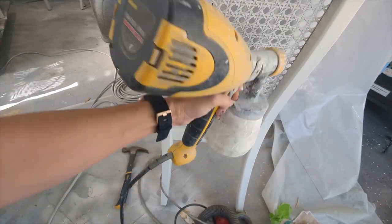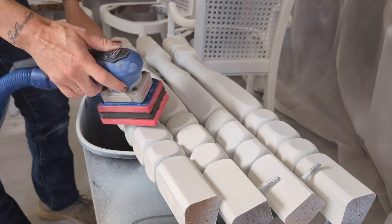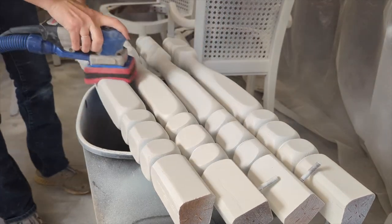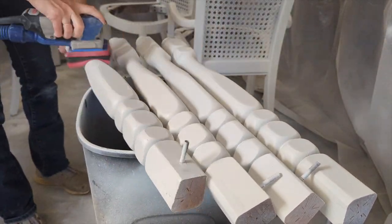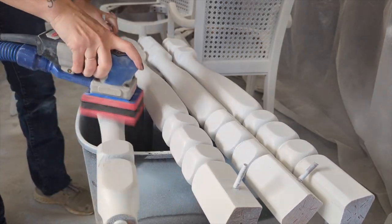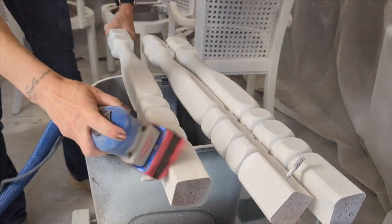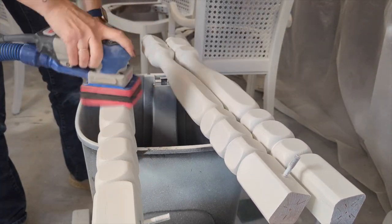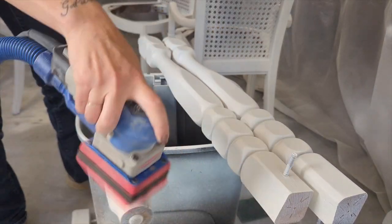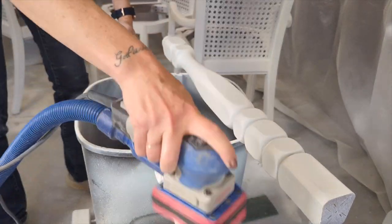I'm going over it with that primer again to make sure that everything is primed and ready to go, and then I can fix any other places that need to be repaired. It's not perfect, but it's a good broken masterpiece. When shellac primer is sprayed or brushed, it does need a little bit of a buff. I'm using 220 grit — pretty fine — just to get off any rough spots or any splatter. It makes the surface ultra smooth, gets rid of a lot of imperfections, and then you just wipe it down with a tack cloth before you go to paint.